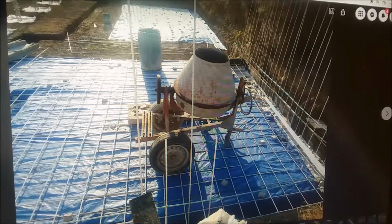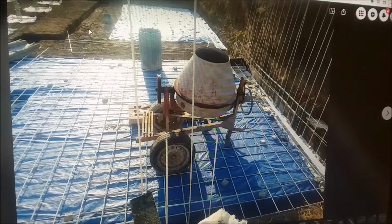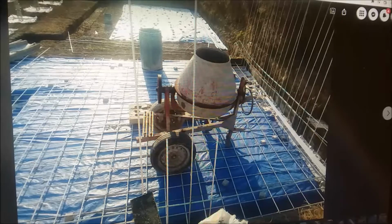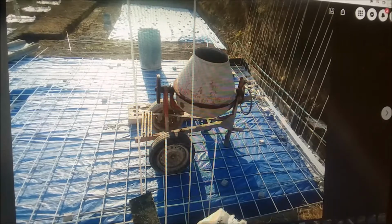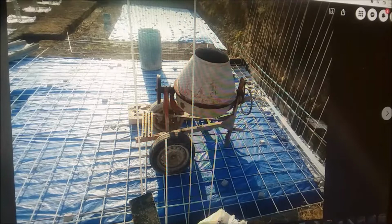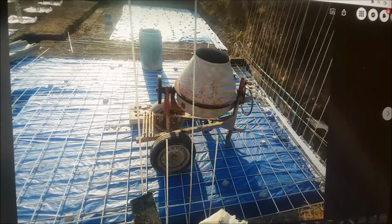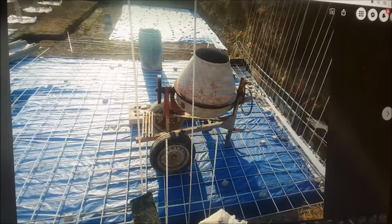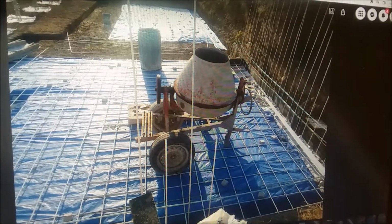Oh, you can see there's a pretty generous power room here. It's 12 or 14 feet by 30 feet. That's just for the inverters and batteries. There's nothing else that goes in that room. And they're going to be spread. They're not going to be 8 inches apart like the minimum in the installation manual. They're going to be like 4 feet apart. And the batteries will go between the inverters.